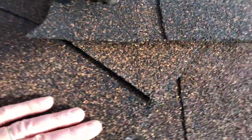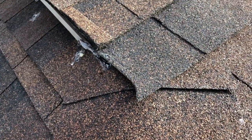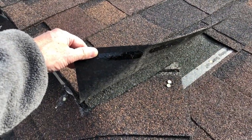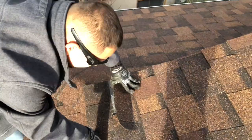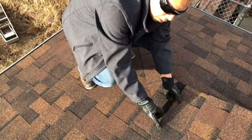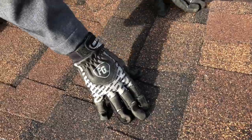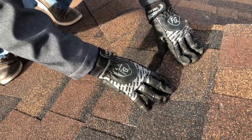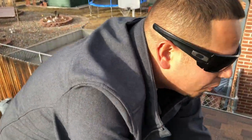Look at this — it's a new design method where they have a little hook on it for the wind to catch. I believe this is called the hitchhiker roofing applique — meaning someone that's hitchhiking gives them a ride and has them help install the roof. Now you can see they did a beautiful curved edge cut, but that is not what you do. This shingle should have been cut at the joint. You never overlap another shingle onto another course — it's never going to sit down flat. There's a huge gap, especially with the double thickness from the applique, which is going to hold it up at least an eighth of an inch. You're never going to have the sealant touch down. That is not the right way to do it — it needs to be trimmed.